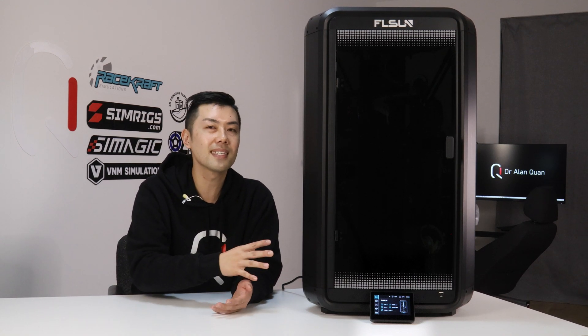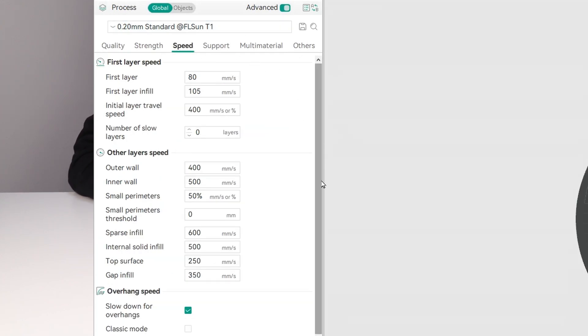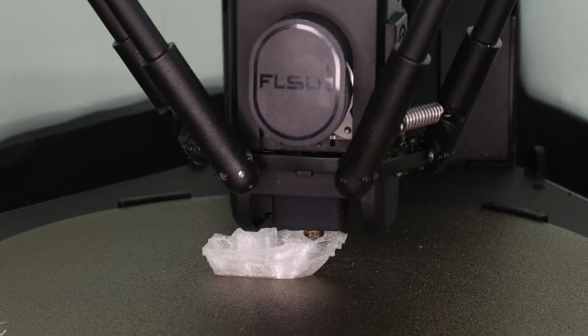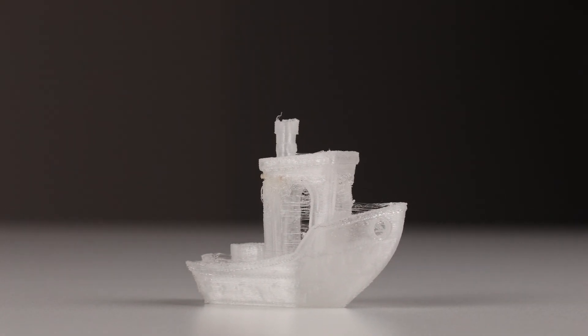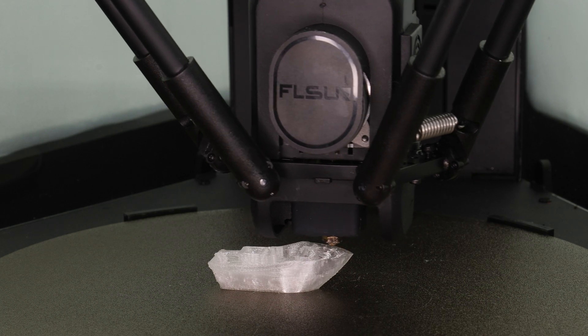All in all, my conclusion is that although there are definitely some quirks to owning and using a T1, the print speed and print quality are really quite phenomenal, and it does things that no printer in its price range can do. With its super high print speeds I was able to just get projects done quickly, and I definitely see the strengths of an ultra-fast printer like this. You don't have to run the T1 at insane speeds — it's perfectly happy printing slower. I'd like to see more default print speed profiles, particularly low-speed ones for filaments like TPU. For fun, check out this 16-minute TPU Benchy printed at 600mm/s — not perfect, but fun. And here's a more reasonable 30-minute TPU Benchy at 240mm/s, which is crazy fast for TPU.